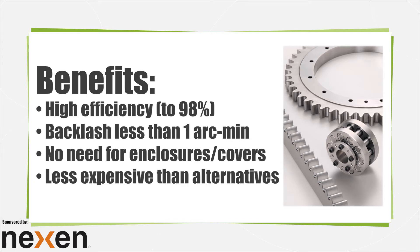They're often less expensive than comparable linear motors when stroke lengths are long, so that a rack and pinion set can cost half of what a linear motor costs, especially for many meter strokes.